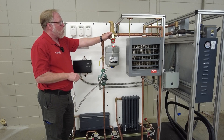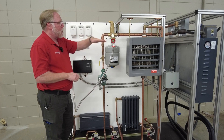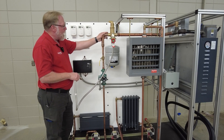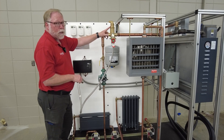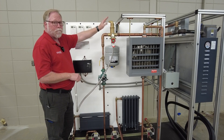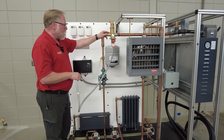These are preset so you don't have to adjust that, but what you can do to fill this up fairly quickly is go ahead and lift this valve all the way up — that's going to press this diaphragm down and allow the water to go in very quickly. This right here is an air separator, and you'll begin to hear the air start hissing out of it. It does a great job — let it work.